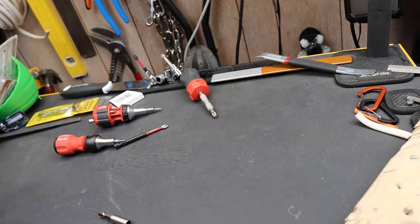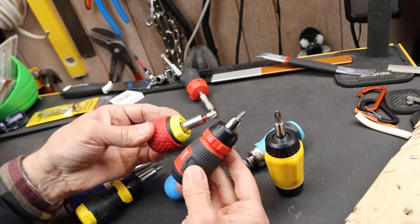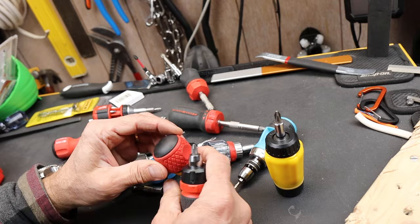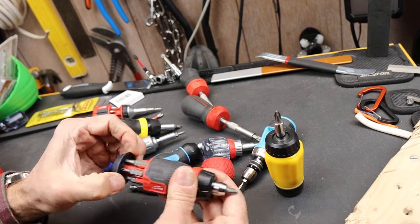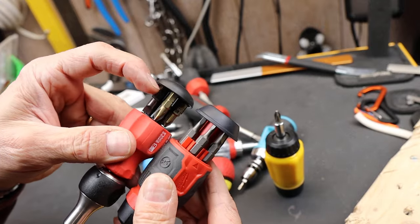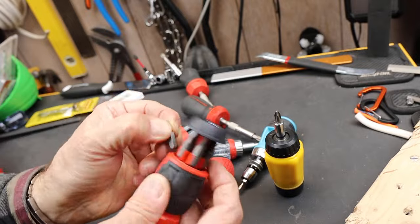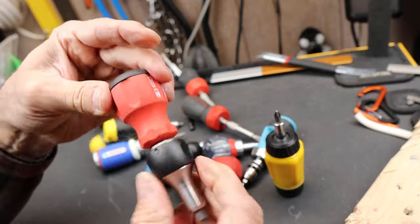When I compare it to others — these are all ratcheting screwdrivers — you can see it fits right in there on the small side, not quite as small as the Vessel, with the GearWrench on the larger side, but anyway all of these are ratcheting. Some of them have bit storage of various kinds, whether you can easily get into it or not or it falls out. This is overall reminiscent of the PB Swiss — you just pop up a cap and reach in there. They do reverse the direction of holding the bit so these are bit-up, which might be a little easier to see depending on your lighting. In and out, no problem. It doesn't have quite the pop of the PB Swiss, but I'm not even sure they're making that one anymore.